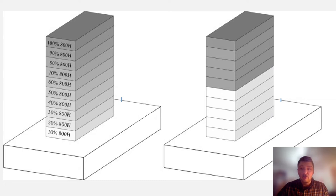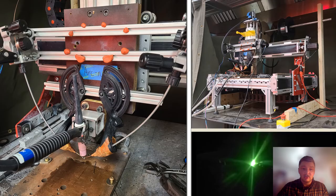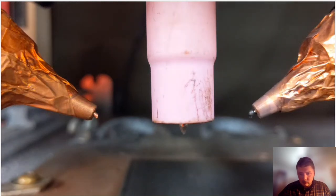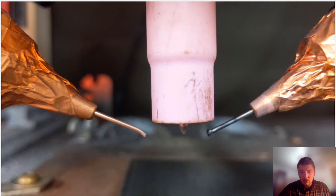While single-wire WAM has occurred on the Michigan Tech campus previously, to accomplish a graded structure, our team needed the capability to simultaneously feed two wires into the melt pool created by the welder, thus bringing about the creation of the ArcNid WAM. The ArcNid printer is a complete overhaul on a previous WAM project that had been using a MIG welding method to deposit aluminum for aerospace applications. To effectively melt two wires at varying feed rates, the electric arc produced by the welder could not be tied to a single wire. We got our two wires to feed into the same TIG arc.